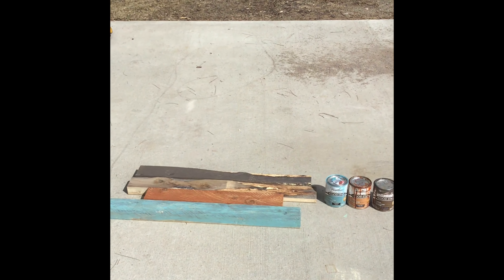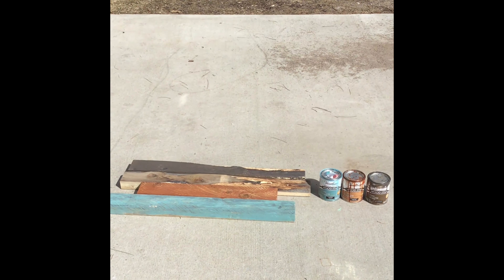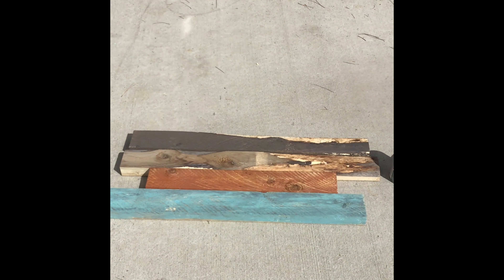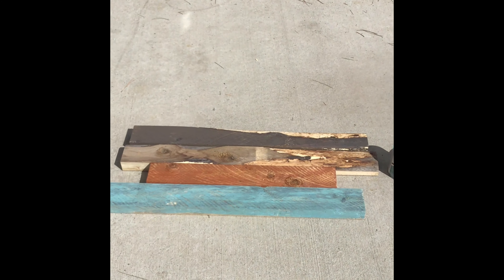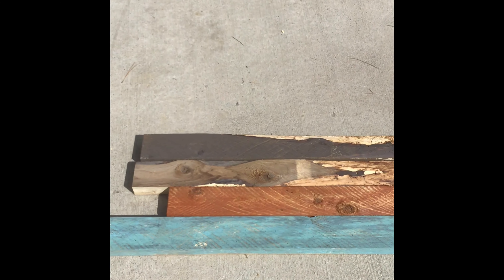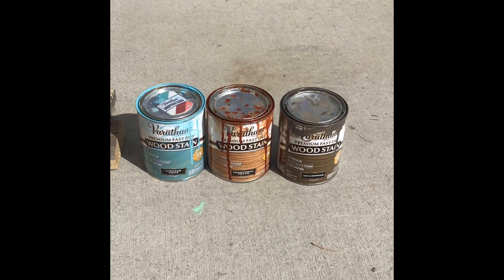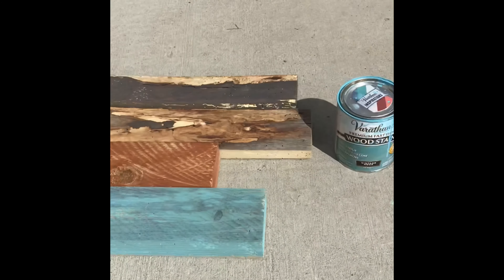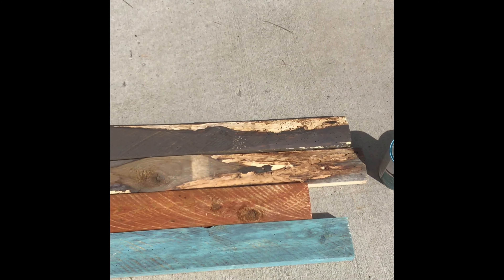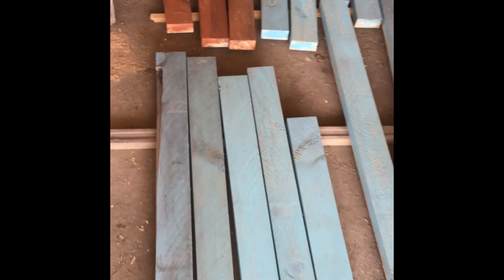The next step is the staining. I went with stain because I want to see the wood grain still — I want them to look like wood rather than paint. I've gone with four different colors: vintage aqua, which is the blue one; traditional pecan, which is more of an orangey color; a natural one; and briar smoke on top. I applied them with an old t-shirt rag and did it differently on each board because I want some darker and some lighter. Now I'm going to sand them all down to make them look even more rustic.